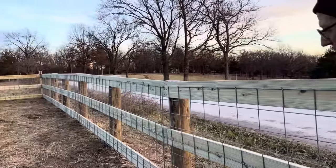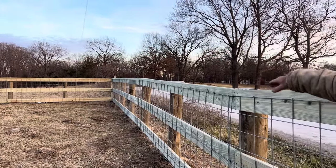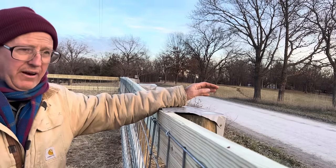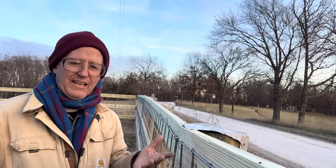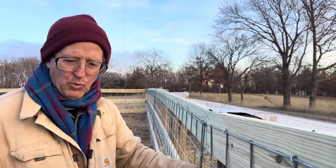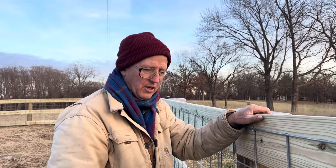You look down through here — the boys really did a good job. They were putting up the boards, and I was coming along helping Joel put the cattle panels on. Jan helped me this afternoon putting nice covers on our posts, because those centers will rot out — even though it's treated, it'll rot out if you don't put that on there. You've got a significant investment here — why not protect it? That's the way it's going to last us the rest of our life. And all these posts are set in waste rock. You can't move it — it's like a tree. That's what you want: a nice, solid corral.